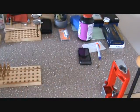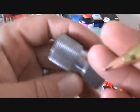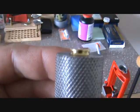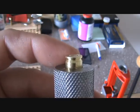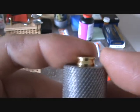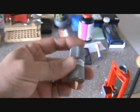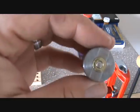If you start having a cycling issue or get some rounds you think are suspect, just drop them in here and see. If they fit in this gauge, they should fit in a standard chamber. Some people say they need small base dies, but I've never had problems with that. When you resize, you have the width of the shell holder, and some cases go about halfway while others go all the way down. If they fit this gauge, they should definitely fit in the chamber — that's the factory spec right there.